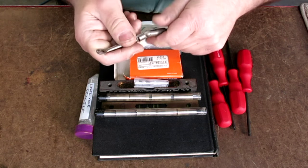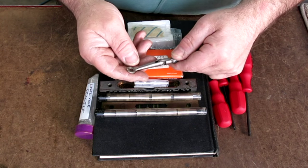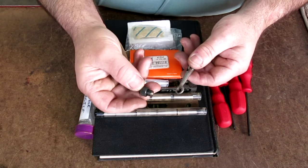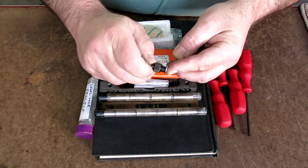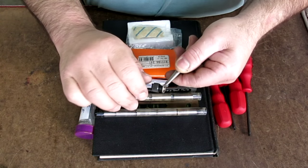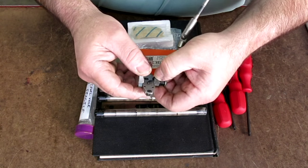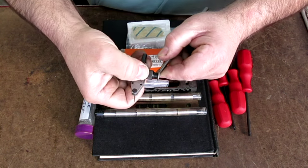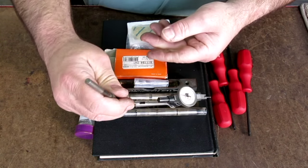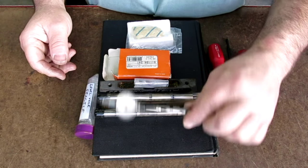This is an indicator arm — kind of a double-jointed indicator arm — made by the Moore Precision Tool Company, the guys that make jig borers. It's kind of a universal deal, and it has a fine thread in here for attaching an indicator. It's split so it's a friction fit, with a little 5mm dovetail. Now you can lock your indicator, use the indicator as a wrench. You can attach an indicator with a dovetail — goes in a chuck or collet. Made by Moore, which is always neat stuff — a really fine tool making company.